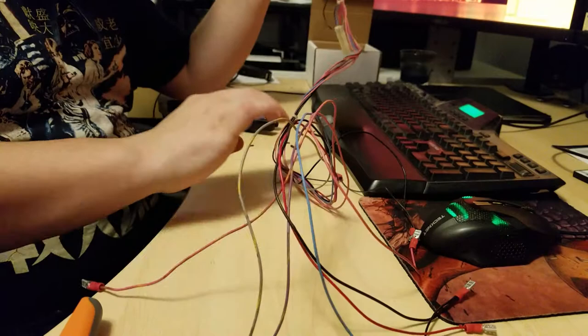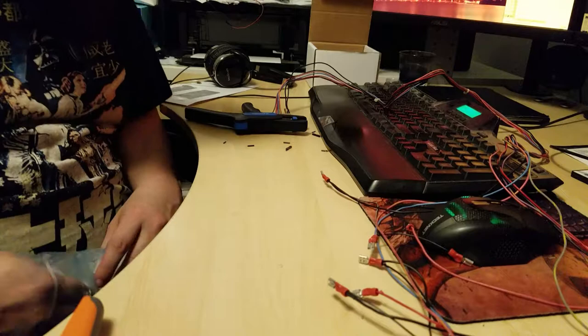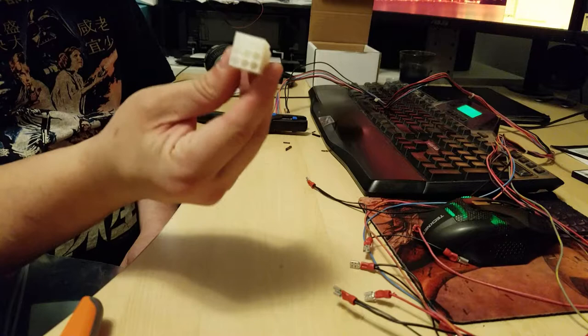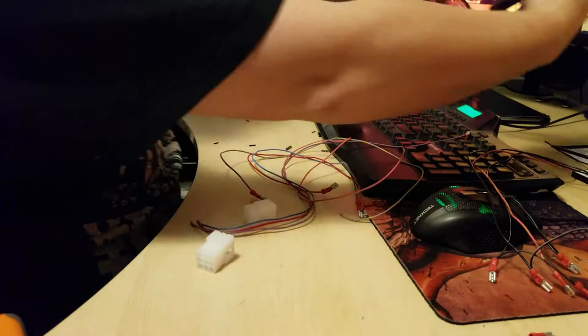All the terminals are on, and again, I can now just take this down and attach it, but for portability's sake, I'm going to chop all these off and connect them all to a molex, and the same on the other side. I had thought before about splitting these up into player 1 and player 2 sides and attaching two molexes. But we have 8 wires here. Let's just keep it simple and use one molex. That was easy. Let's get it all done at once.